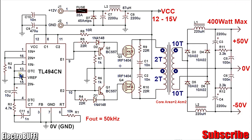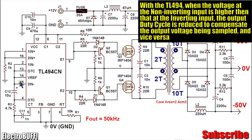To set the output transistors as a push-pull driver you'll need to pull up the output control pin 13 to 5 volts, which is generated by pin 14. To disable the error amplifiers you'll need to pull down the non-inverting inputs pins 1 and 16 to ground via the shown resistors, and pull up the inverting inputs pins 15 and 2 to 5 volts generated by pin 14 as shown.